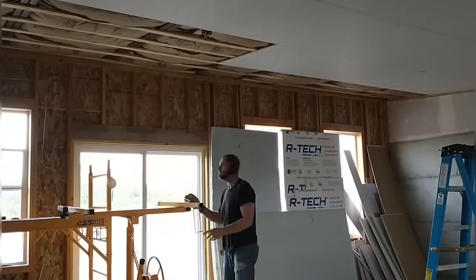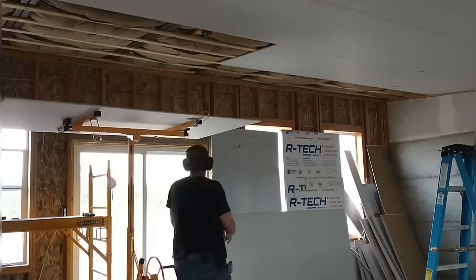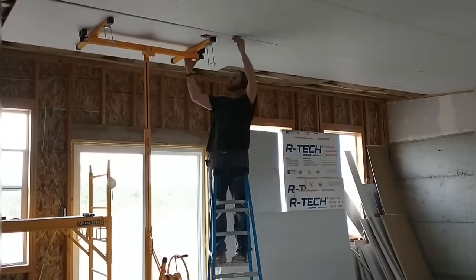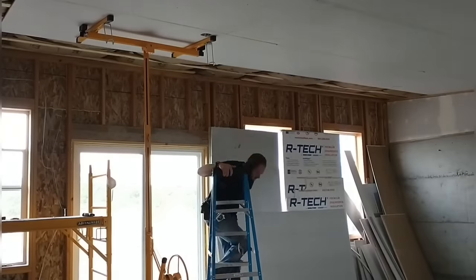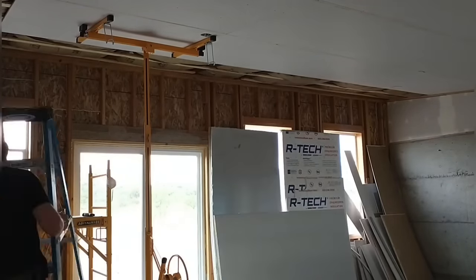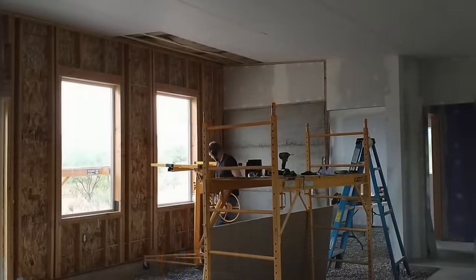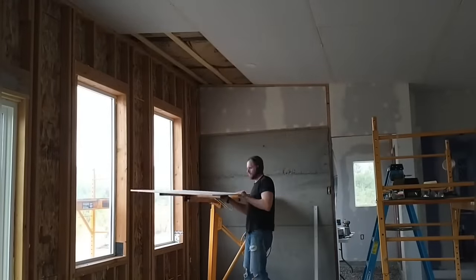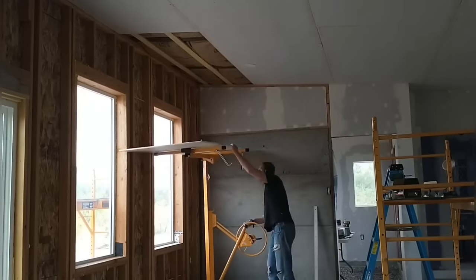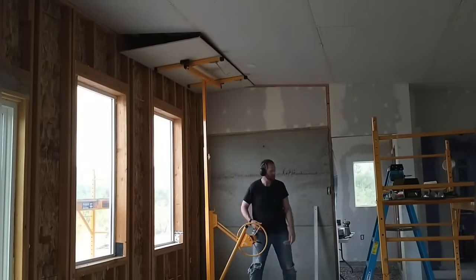I should mention why we have all this gravel in the house. The reason this gravel is still exposed is because we plan to come in later and cover this section of the floor with packed earth — it'll be a natural earthen floor. We want to wait until most of the construction is done so the earthen floor doesn't get damaged. We'll also be putting down insulation first before the earth goes down, so the earthen floor will be thermally isolated and will act as thermal mass.